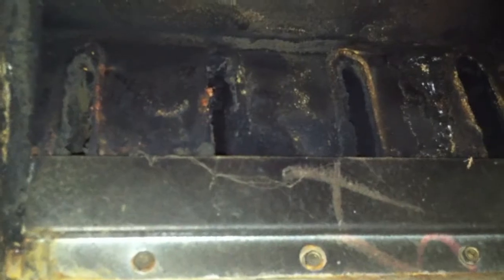And with those burners removed, I have access to inside here, which you can see is also very full of soot. This is where the draft occurs. Those are the tops of the exchangers, and it appears there are no blockages. I can hear the wind up there. I might go up top and pop the top off during daylight tomorrow just to check, but I don't suspect any blockage there. I'll try to clean out those orifices as best as I can.